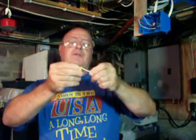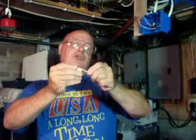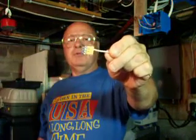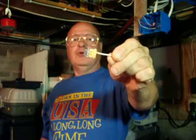So it goes in like that. I can feel the tab inside, and I have a little bit of copper showing below here, so I'll push it in like this. You want the copper to go up to the top so you know it's got a good hold on it. And you want the insulation of the wire to go into the bottom of the connector so that it's not exposed.